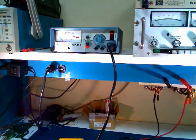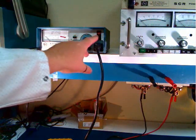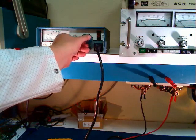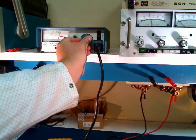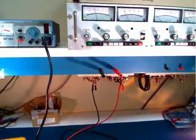Now that we are all connected up, turn on your AC source and if you are using a variable model, set it to the lower limit of the acceptable AC range per the specification. Note that the power supply starts and you can see the output voltage appear on the voltmeter. By varying the AC input from minimum to maximum input range while monitoring the output, you will establish your line regulation.